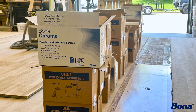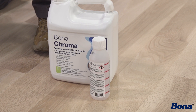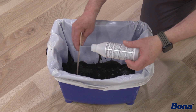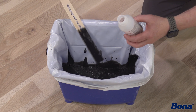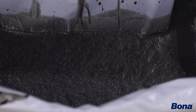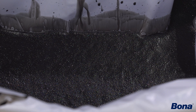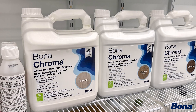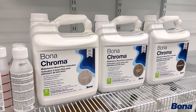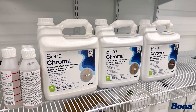Anytime something like that happens to your product, I would test it out. Watch it — you think it's okay — but then while you're stirring the Part B additive into it, if you see anything funky happen, or when you first apply it to the floor it seems like there's way too much foam, or it's not forming a good film, or not forming a nice even color, it may have been damaged during the freeze-thaw stages. Take that product out, remix one that wasn't frozen, and continue on from there.